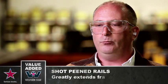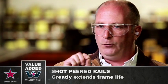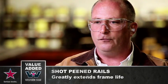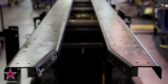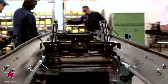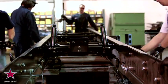The shot peening is like a swarm of very tiny little steel BBs that hit all around the outside of each hole, both sides. What that does is it reduces stress risers to give you a very long frame life. Here behind me, they're assembling the frames by sticking them inside a jig, placing the cross members inside, and then the hydraulic cylinders will fold up that frame into the cross members.